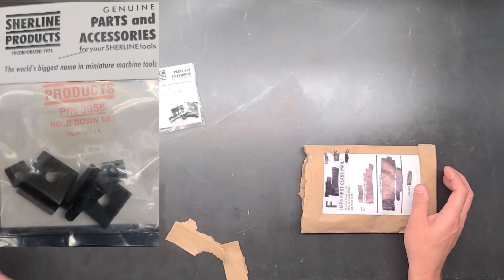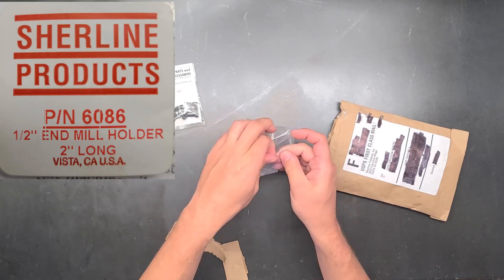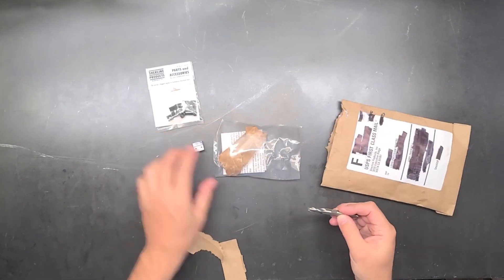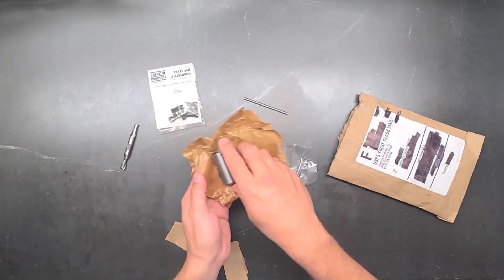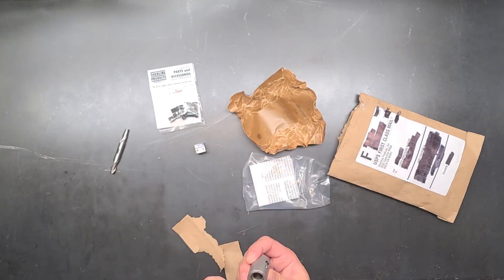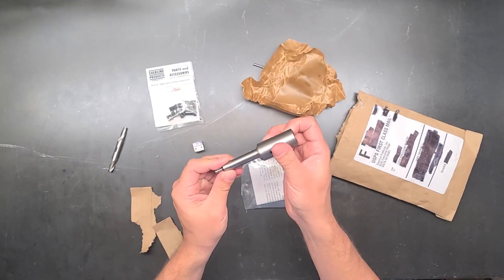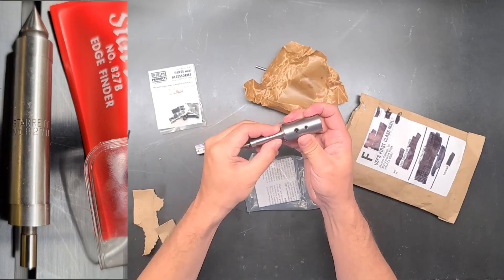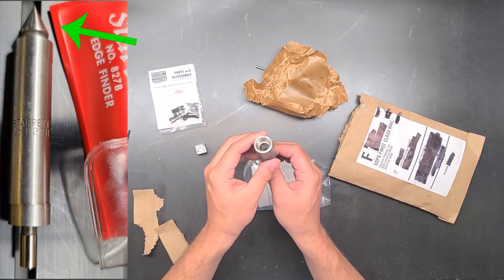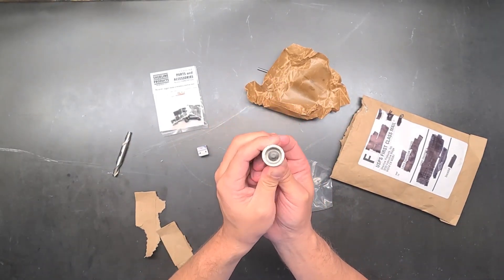Today's star from Sherline is going to be this half-inch by two-inch-long end mill holder, part number 6086. It comes with the tommy bar but it doesn't come with a hex wrench — normally Sherline throws a hex wrench in with everything you buy. It's much bigger and beefier than the three-eighths holder. It's going to let me use my half-inch diameter Starrett 827B edge finder, which has the traditional end as well as a hole-centering feature, giving me many more tools and capabilities.